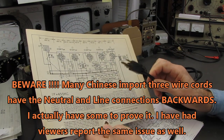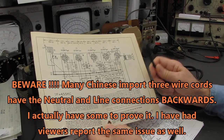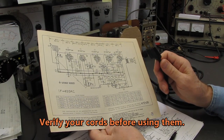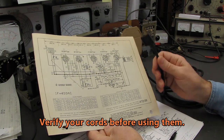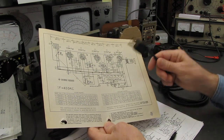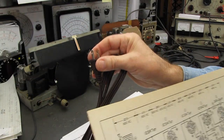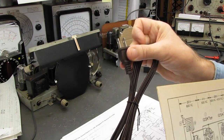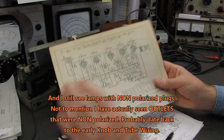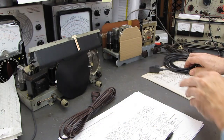I no longer do it because I had so many customer complaints here in New England. So many houses don't have the 3-wire outlets, or they take up too much room in the outlet. And I had so many callbacks, because you can't get through to some people or explain to non-technical people why we do this. So we revert back to the 2-wire plug, which has been working fine on lamps for years as long as the lamp is wired correctly. No question, this would be a safer set with the 3-wire plug, but there's only so much you can do.